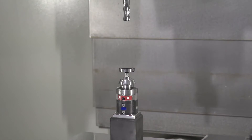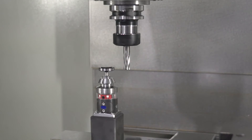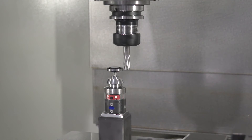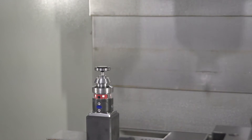How does it do that? You physically touch on the probe itself with the cutting tool. When the probe is deflected, it sends a signal wirelessly through an infrared link to the CNC control, and we capture the axis positions and do all the calculations within the software for calculating the tool length or the tool radius.